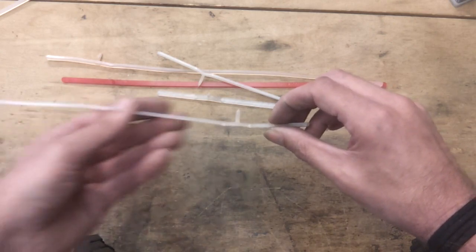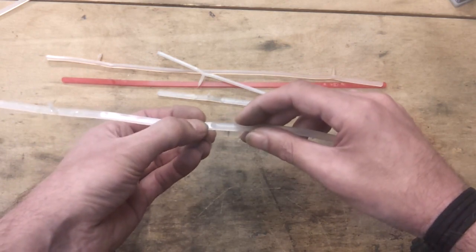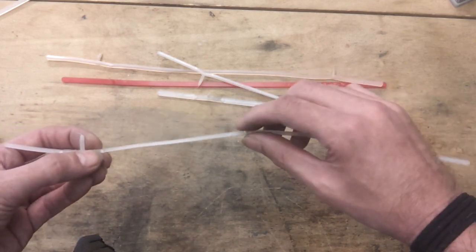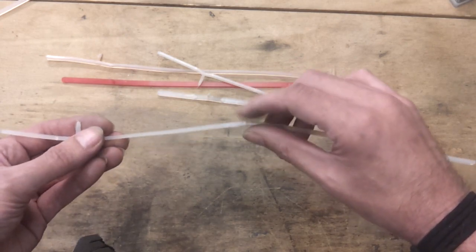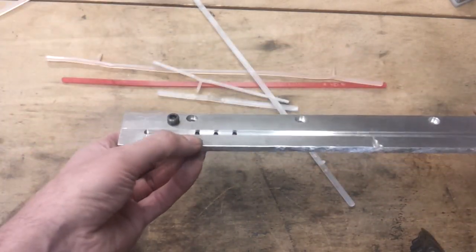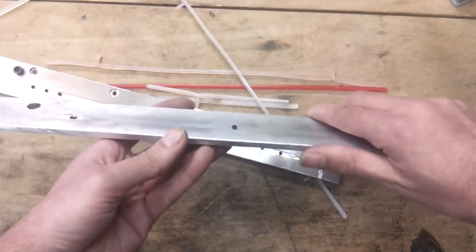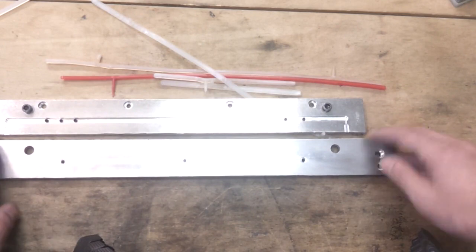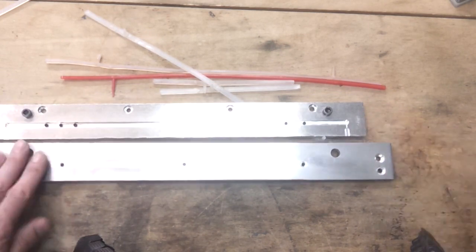That moulding still had a bit of a bump because I didn't add the pin behind the sprue on that end. In the centre there's another grab pin on the other side about 100-110mm apart, and when the mould opened it clicked off because those held it more firmly. That's the three pins added on one end and two on the other, plus the one in the middle on the fixed half. All in all, that's quite a good technique and I shall definitely be using this in future, possibly improving on it even further — not bad for a quick experiment.